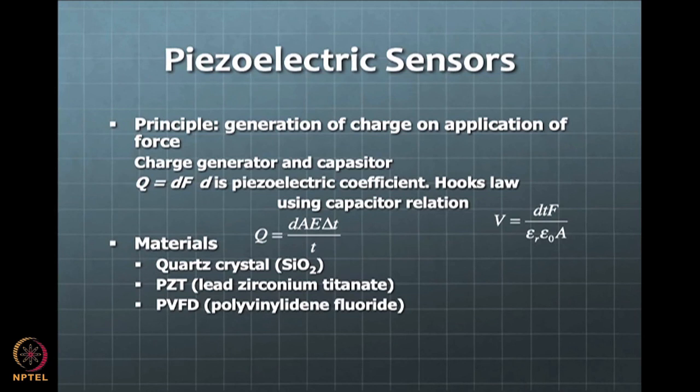The idea is that the sensor is sitting in some industrial environment where some vibrations are present. Based on those vibrations, it is generating energy to power itself. So the sensor doesn't need an extra battery or any solar or other kind of power source. In the industrial environment, whatever vibrations there are, it generates power for itself from them. That is the kind of idea used in piezoelectric energy harvesters.